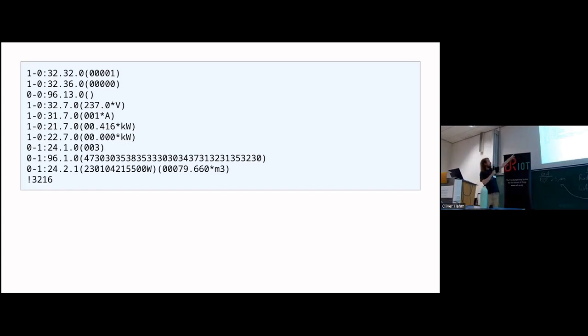And the almost last one. The last one is the CRC, and the one above is a timestamp and the gas meter usage that got plugged in via one of the other ports. That gives me, once per 15 minutes, my gas usage, with a timestamp. It's 2023, something, something, and then whether it's daytime or nighttime. It's a very interesting format. Don't consider this one if you ever write your own.